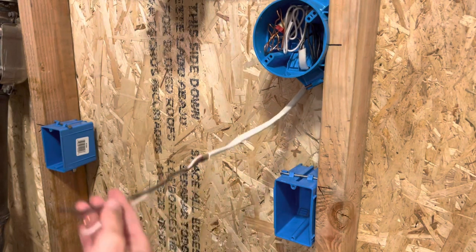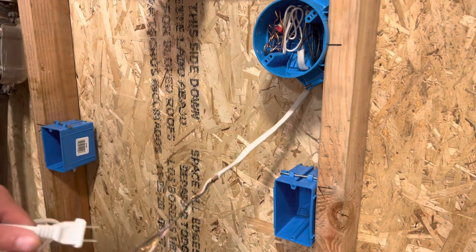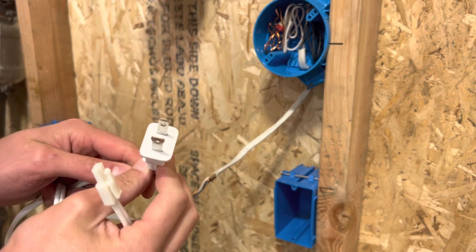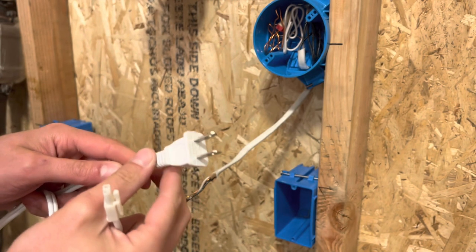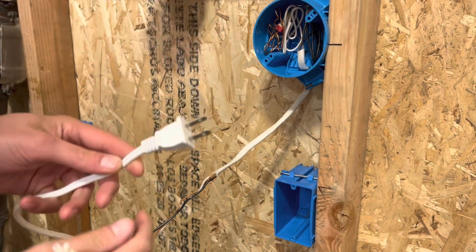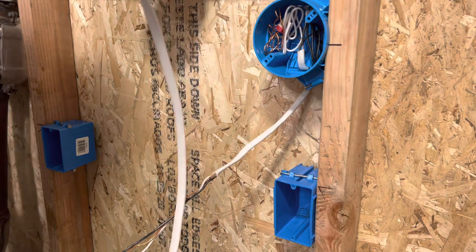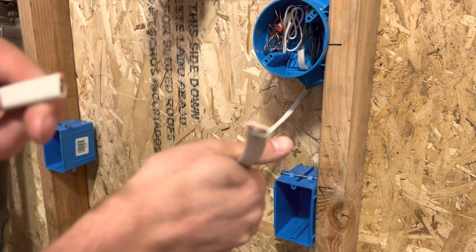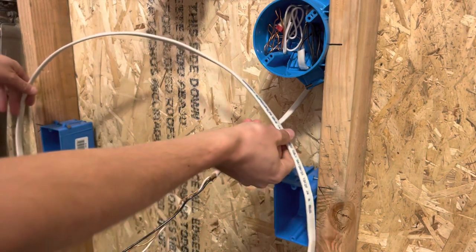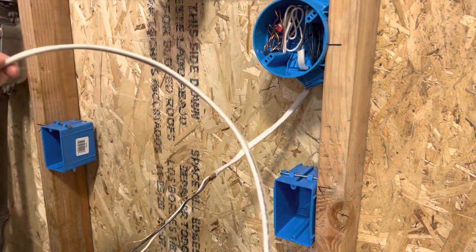So I got the switch leg right here, which goes up to our lights. Here's my switch leg, and then I have this wire right here — it doesn't have a ground in it, but I'm going to cut the end of this off. This is going to be my power wire. I'm going to plug it in in the next video. And then I have this little piece — a little tiny piece of three-wire right here, 14-3. It's probably a couple feet long. So what you're going to need is a switch leg, a three-wire, and a power source.